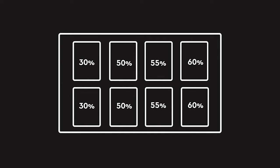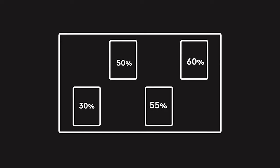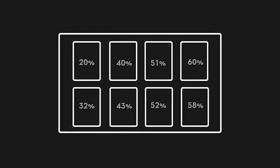The battery station will charge the batteries successively by group. When many groups of paired batteries are charged at the same time, the battery station will charge the paired batteries with the most power first. If no batteries are paired, it will charge the two batteries with the most power first. When the power of the paired batteries is not the same, the battery station will charge the one with less power first, and after these batteries show the same power level, the station will charge the paired batteries together.